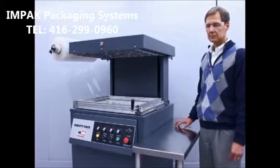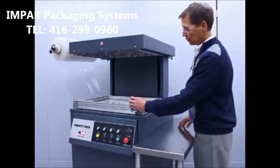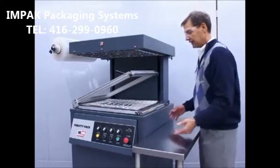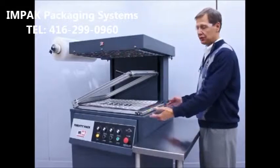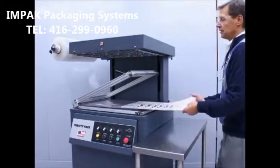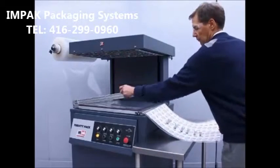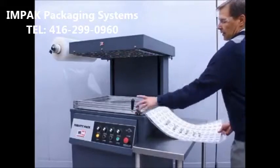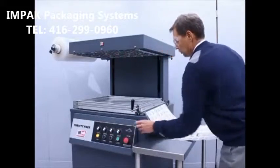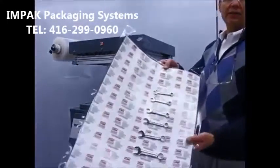So let's take a look at it. Upon completion of the cooling cycle, the film frame is simply opened and the card can be removed. This Thrifty Pack does contain the optional hot wire cutoff, which eases the removal of the finished product from the sheet. The finished card is simply pulled out. The film frame is locked down, and when the frame up button is depressed, the hot wire cutoff is initiated and removes the finished card with a secure, attractive package.